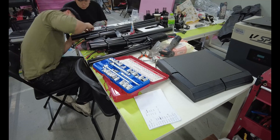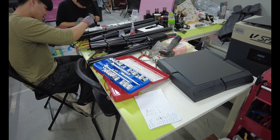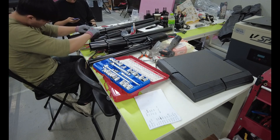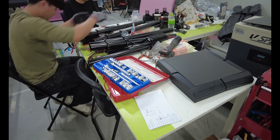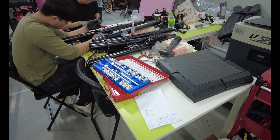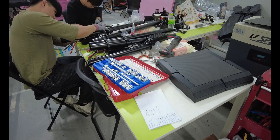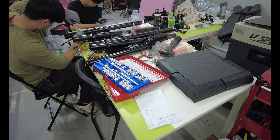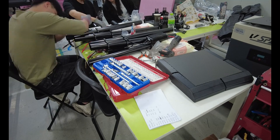This battery is big and heavy. I use a jack to lift it, just like in an electric vehicle. Lifting it by hand isn't safe. The jack lets me raise it slowly and hold it steady while I align the mounting points. The battery slides into a reinforced cradle under the frame. The locking point has to match perfectly — if it's off by even a few millimeters, the whole fit becomes unstable. After positioning, I secure it with mechanical locks.